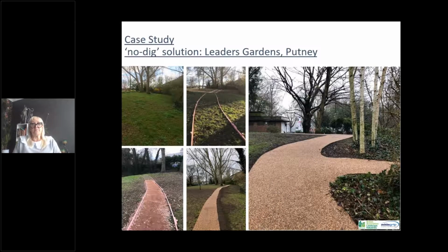This is a particular project that we've done, and if we go in order of the photographs there, up in the top left was a pathway. It was just soil, it was the earth, the ground. It was scraped away to make as level as possible, and a timber edging was put in place. The bottom left hand picture shows some hogging, some limestone, which is then used just to make the ground as flat as possible rather than for a base. It wasn't used down the whole way of the pathway. The grid system was laid on top of the hogging. The resin bound surfacing was then put on top of that, and then the edging was removed and the pathways were left there. So there was absolutely no dig out required in this instance.